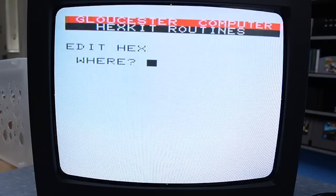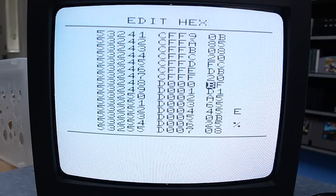This software lets you load, save, or edit hex files, and then burn them to an EPROM. Since it only handles 2K and 4K EPROMs, it's not all that useful to me — if it could do at least 8K EPROMs I could probably find some interesting uses for it. But it's still a pretty neat little device from the time period. I think it was targeted a lot at ham radio operators who needed to reprogram EPROMs in old ham radios to change channels and settings. Of course, none of that is necessary on modern ham radios because it can all be done in software.